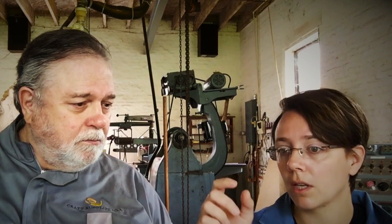And then you start having to look at the piece more in terms of where the spalting is and following the spalting instead of following what you wanted to do. And that can lead to some very interesting shapes. And just because of the way fungi tend to grow in wood, it often leads to pieces that have wider bottoms. It often, at least in my work, can lead to pieces that need to have thicker bottoms or that may not have a continuous wall thickness.